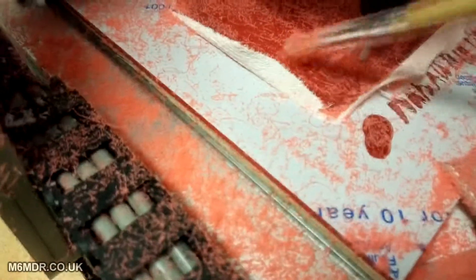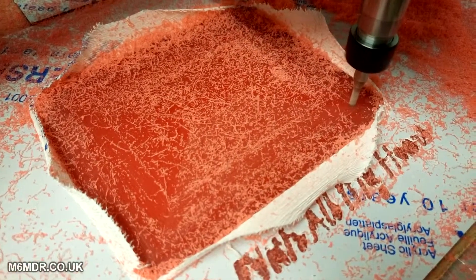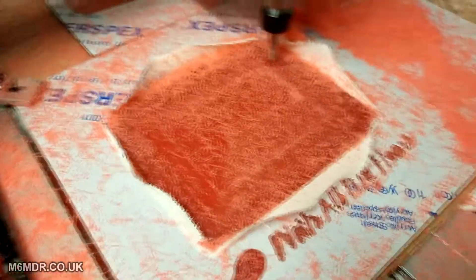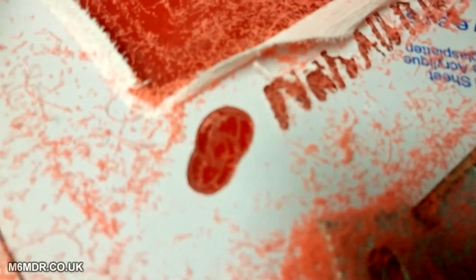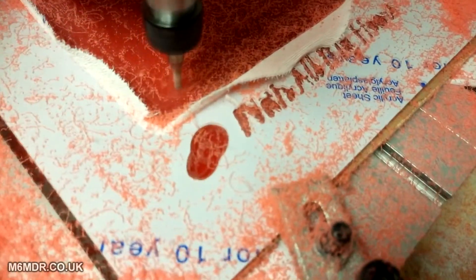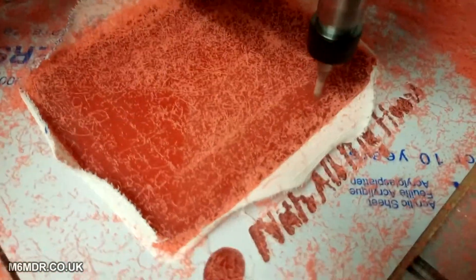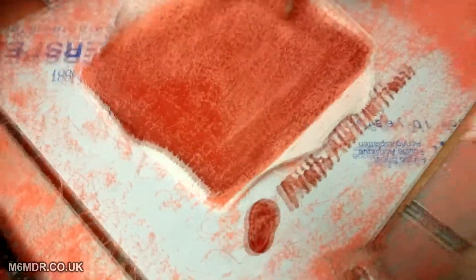Slow and steady wins the race. All in all, if I were to do a clean-up pass on the pocket — I know you can see some ridge lines in there — but if I were to do a single flute end mill clean-up pass, that would smooth it out but add another half hour or so to the job, making about three and a half hours total. The engraving rings take about 50 minutes, text about 5-10 minutes, milling the pocket about an hour, and the cutout probably about 20 minutes.